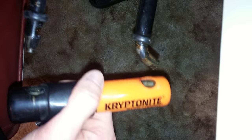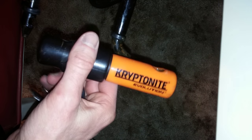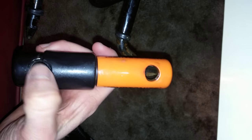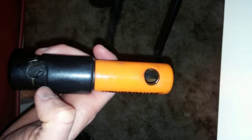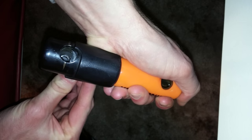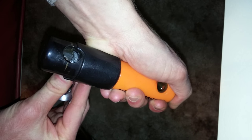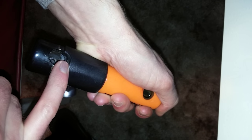To fix this problem, we're going to add some lube to the lock. We're not going to put it in the keyhole — instead we're going to put it on the other side where the bolt is. You can see here when I turn the key, that's the bolt coming in and out. That's where we're going to put the lube, right in there.